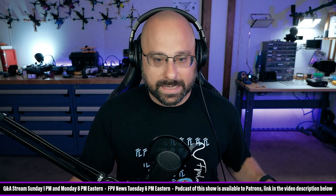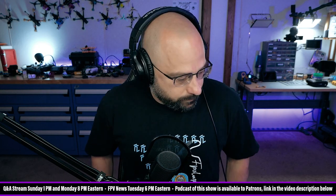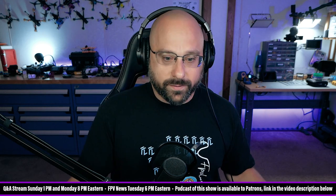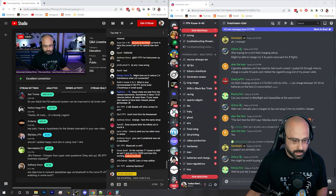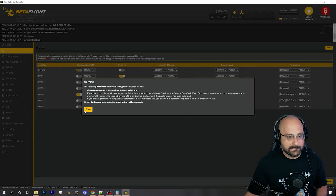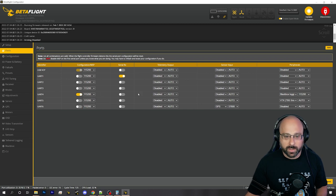So Anthony Greco, do you not see the Mamba Stack Wi-Fi when you plug in? I don't know why you wouldn't see that. My UART 4 was set to MSP, not Bluetooth. QuadDoc confirms I have MSP on UART 4 set to 19200. Let me check the baud rate, just real quick. So I have it set to 115200 and it's working.